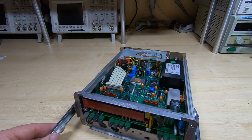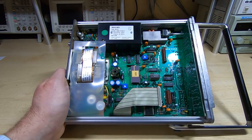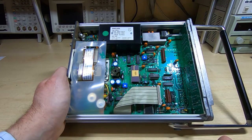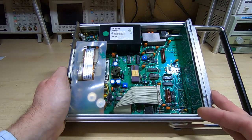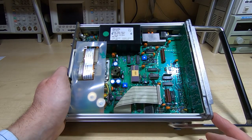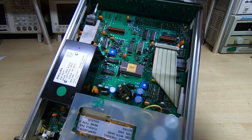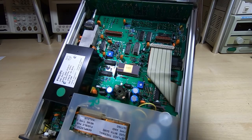We'll have a quick look around the inside, then I'll reassemble it and power it up. Starting with the oscillator oven - very precise. I have run this and although the last calibration states it was 1991, it was still well within spec - only about three hertz out at 10 MHz, which is absolutely amazing.